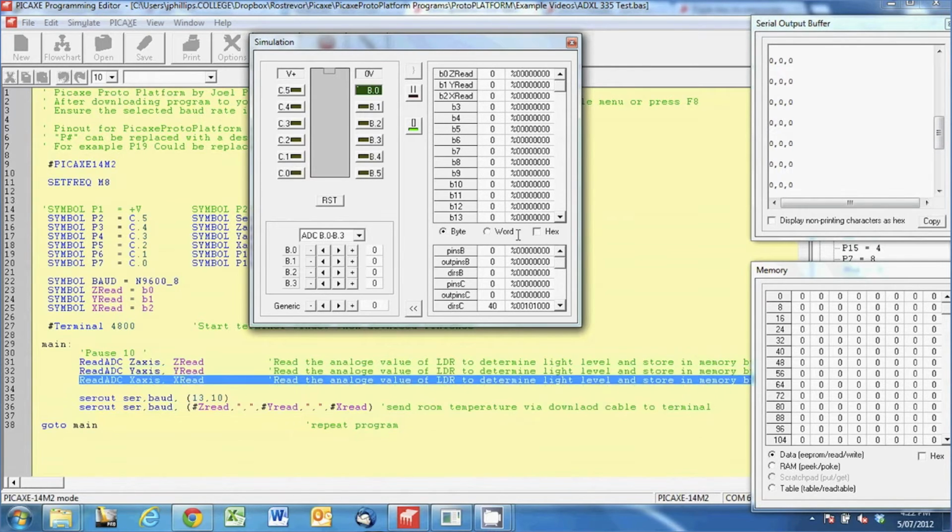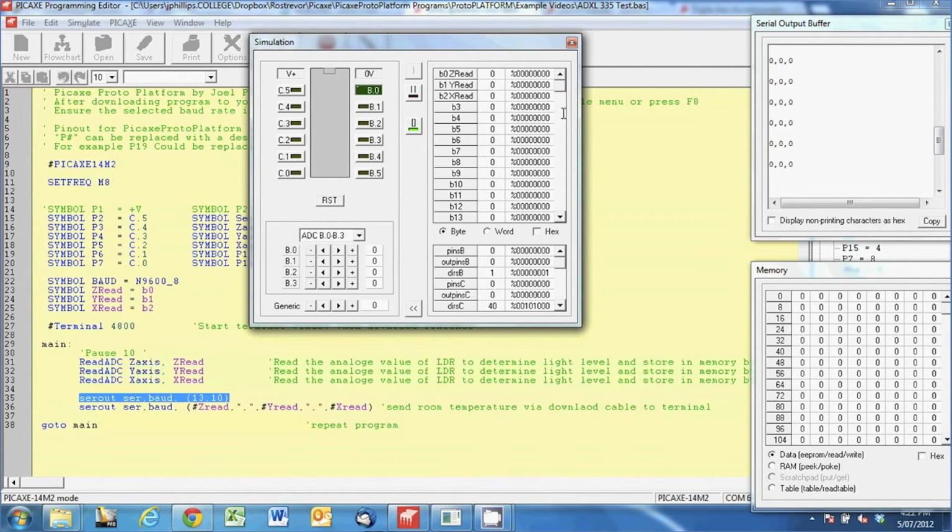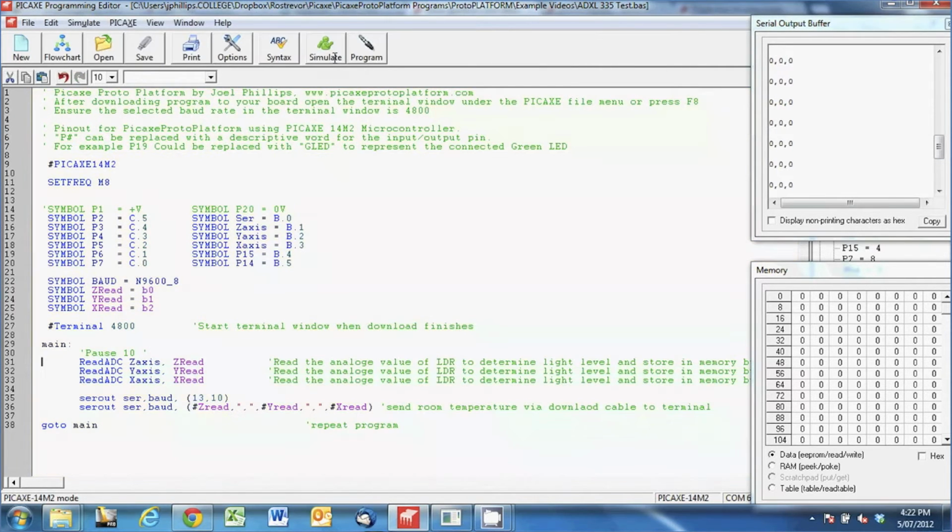No. You used to be able to join the two, but maybe that's in the debug, so I can't show you that. But there are 2 bytes in any word, B1 and B0. Those 2 bytes make up one word, so you can't use B0 and B1 if you were going to be using word 0, because those 2 make up a word.